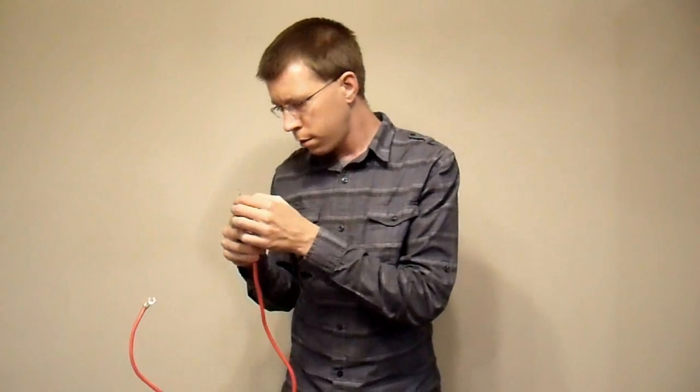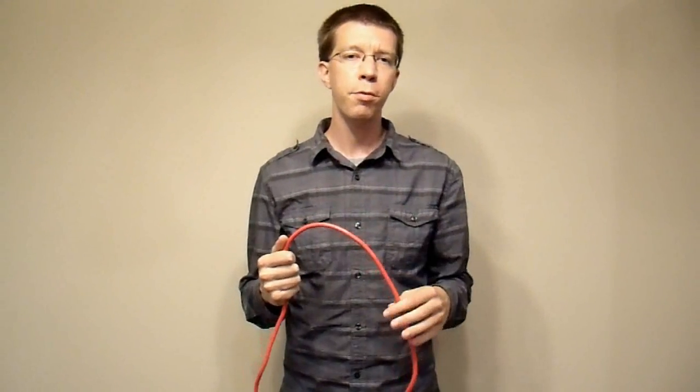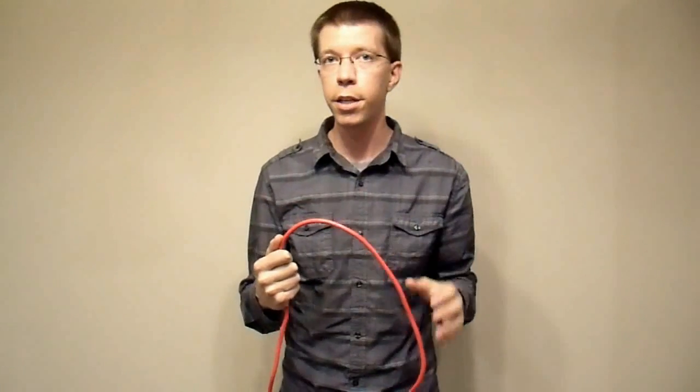This wire only has seven strands, which makes it extremely stiff. There's also another complication: if it's installed somewhere that frequently bends, thick copper wire can only bend a few times before the strands start breaking internally, creating a high-resistance point that can be a fire hazard or reliability concern. You can use household wiring — I'm not going to say don't — but be aware of those complications. A higher strand count wire, even a cheap one, is much, much better.